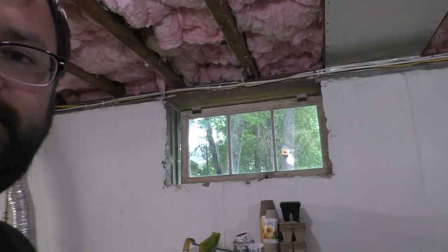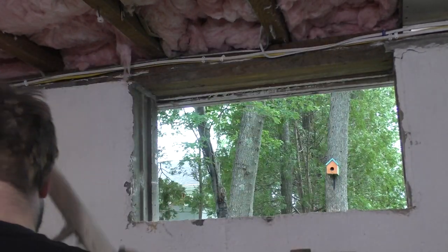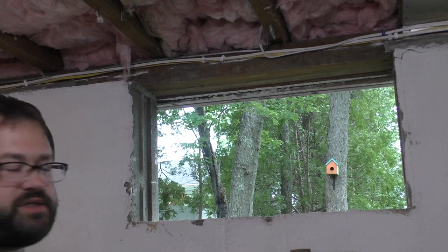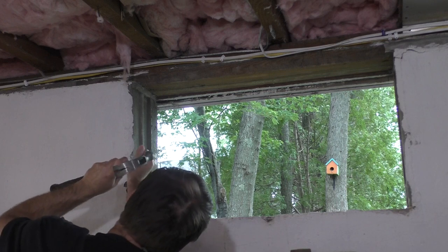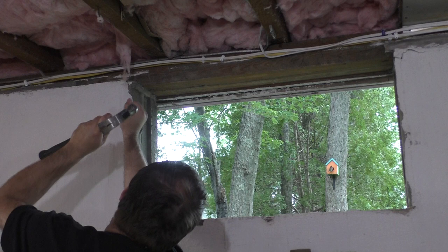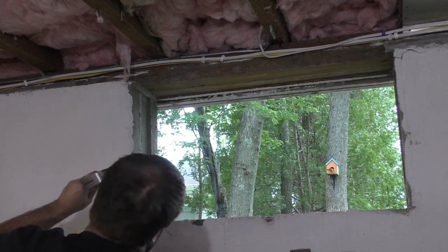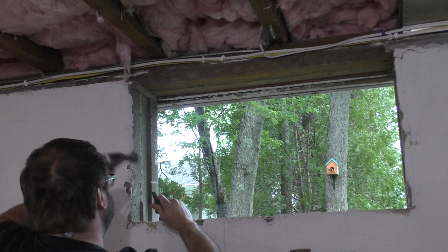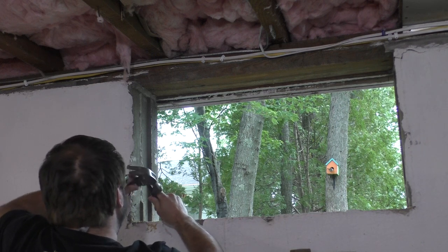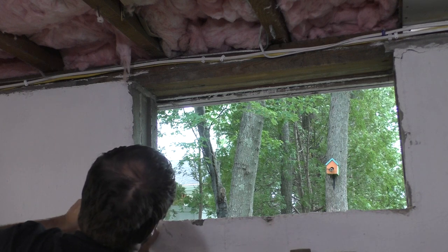All right. About a chisel. This is a Mason's chisel. And what I want to do is remove that lip. It doesn't need to be there, which could potentially get in the way of any later trim work I decide to do. That. I think I might leave the one in the... No, it's actually pretty much gone, so I won't leave that either. I didn't really have to do this, but...